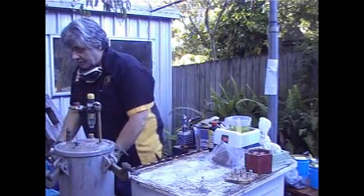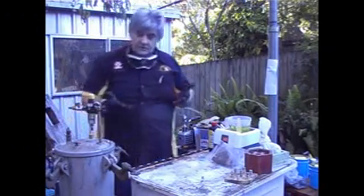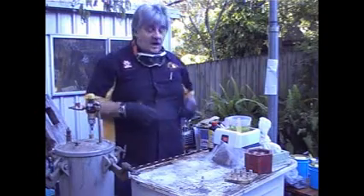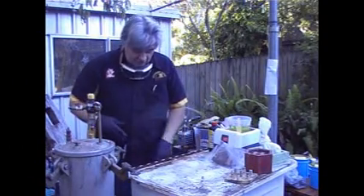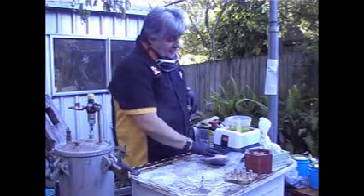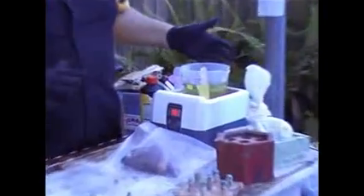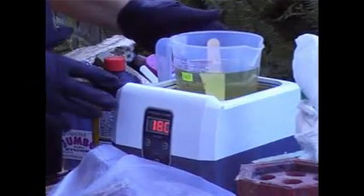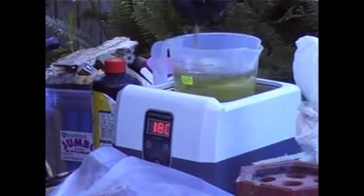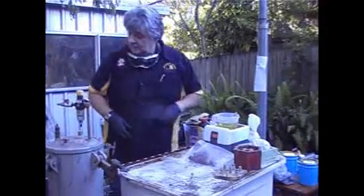The pressure pot is not big enough for this one, so I'm going to do a multiple pour — pour some in, then after a while pour some more once it's got an initial set. You don't want to pour more than about 300 ml at a time, otherwise too much heat is generated. I've got a heated ultrasonic cleaner here to heat the resin to about 25 degrees and vibrate it to get the bubbles out. It's been in there about 15 minutes and the resin's nice and runny.